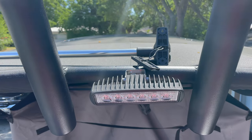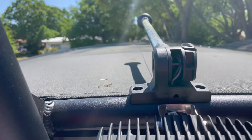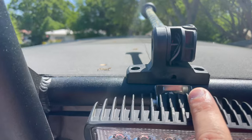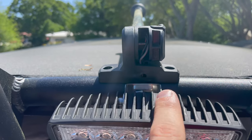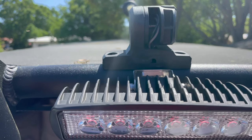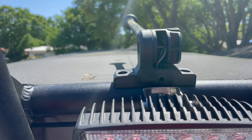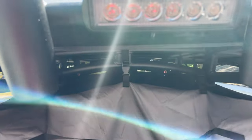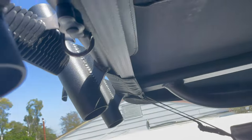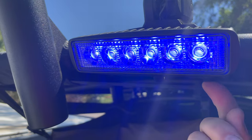This is the finished product. You have your mount screws reinstalled, making sure the length is proper for folding and unfolding of your nav light. One thing to point out: you can put the bottom portion backwards if the holes aren't lining up — if that's happening, you probably have it backwards. It is a single-direction mount with the little hole out the back going toward the right side of the mount when looking at it from this angle. The wiring is all cleaned and tucked away, and you have your mount switch here.